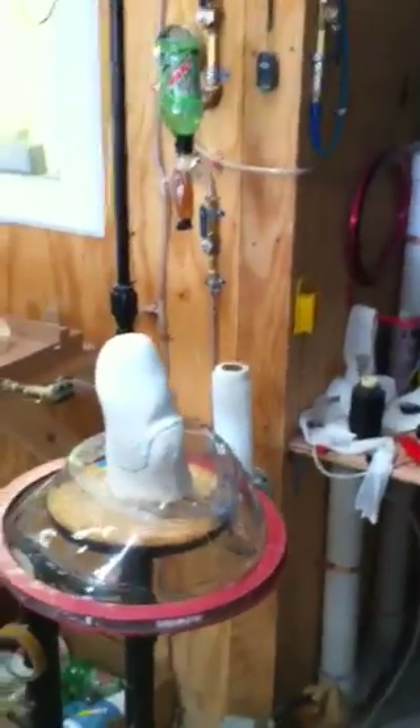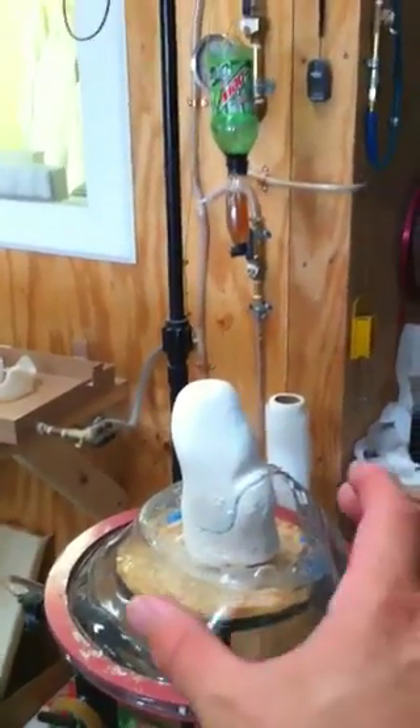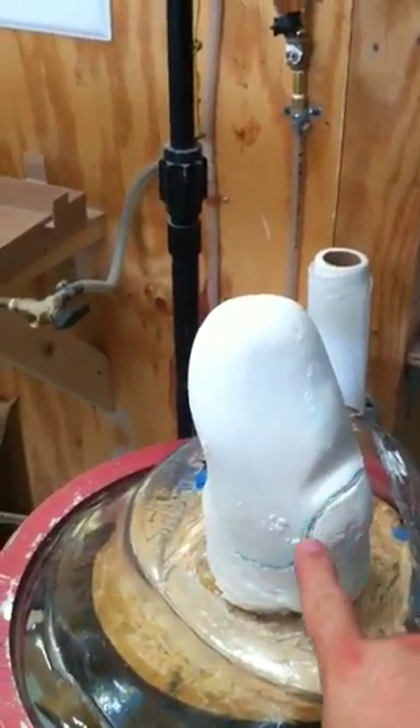From that mold, we then stick it into the oven, heat the mold, and then the mold is placed — we take the plastic, this is one that has already been done. We heat this up to about 400 degrees, and then this is placed in the oven. It creates a bubble, and the bubble is then vacuumed onto the mold. And then once the plastic cools and cures, you can see here where the trim lines are where we've already cut it out once before. And we end up with a test socket.